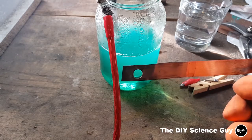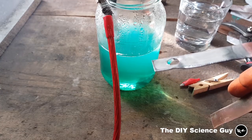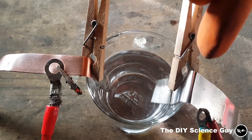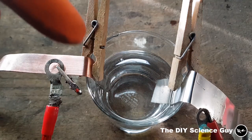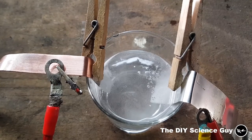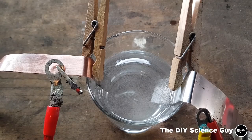Let's test how well it does in a sodium hydroxide solution as the anode, because that's the part that always corrodes away. Everything is ready — now let's apply the voltage. This is the anode side; the cathode side uses a normal pure nickel strip because that part is not under investigation. So only on the anode side I have the nickel-plated piece of copper. Let's just let it run for a while and see how it did.